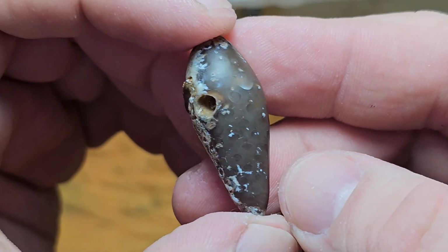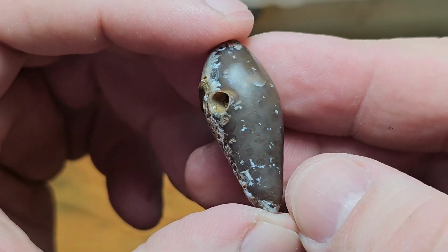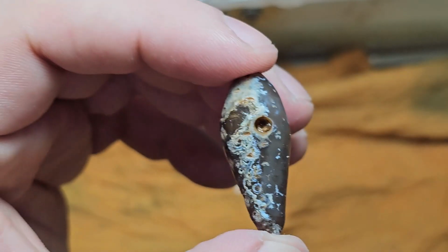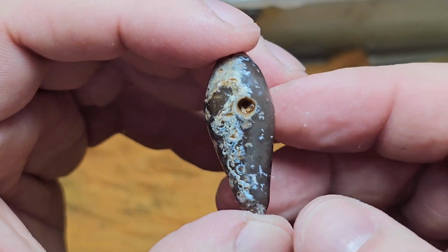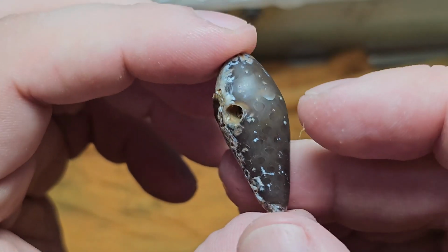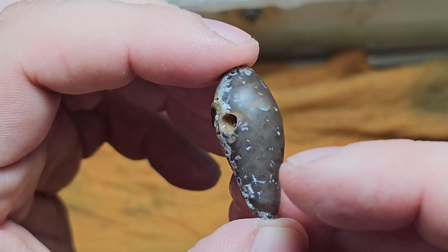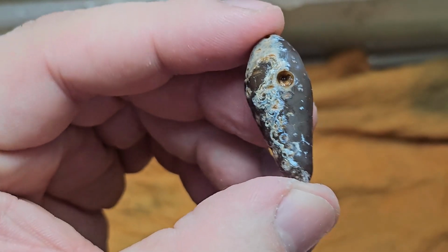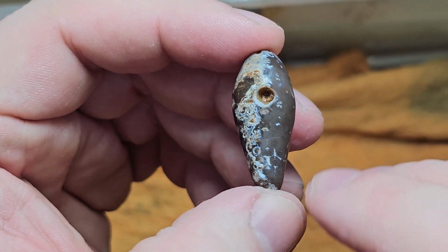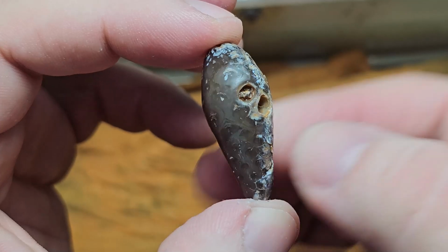Here's our finished surface after the 600 grit Nova point. One thing I didn't explain before was you also want to be blending as you're going. More specifically, if you're doing a one side rough, one side polished type deal. If you're making a cab or you're doing something else, it's not really going to matter. But when you're doing this kind of two-tone, rough finish type deal, you want to blend it. And by blending, I mean this entire time, when I got done with the diamond carving bit, I went through with the 280, and I went a little bit past that. And now with the 600 grit point, I went just a hair past that. And by the time I get to the 1200, 3000, this area will be blended. So that way we shouldn't, in theory, see any grinding marks here on the edge.